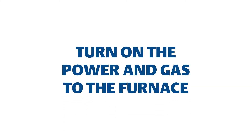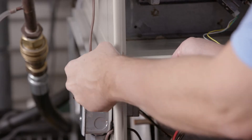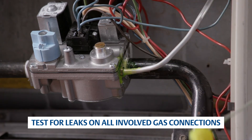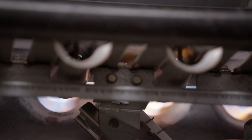The system is now ready to be powered on. Reconnect the electric power and gas to the unit and make sure the door switch is engaged. To check for pilot tubing leaks, make a call for heat and apply leak detection solution to the tubing fittings.